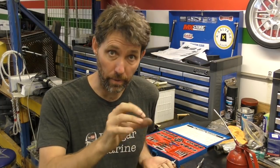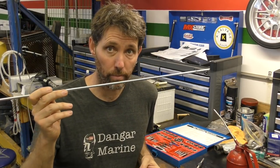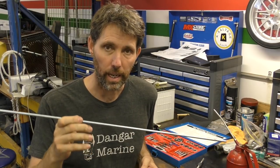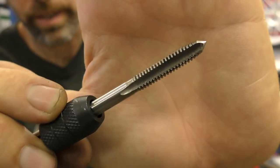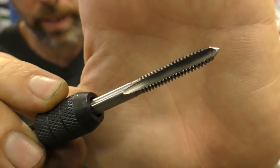Now I've removed the two bolts that hold the bearing carrier in, I can use two other threaded holes to pull the whole bearing carrier out. To do that, I've bought some threaded rod — this is 1/4", 20 threads per inch. I'm just going to cut up two short lengths, weld some nuts on the end, and we'll use this with our puller. I've also got a tap — also 1/4", 20 threads per inch — that we can use to clean the threads out.